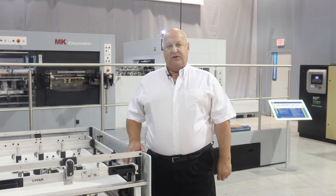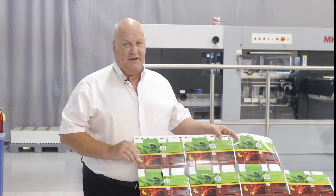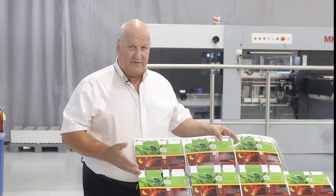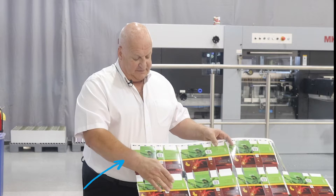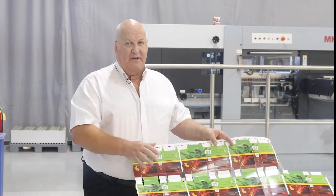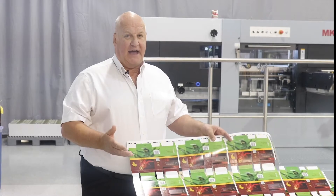First, let's be clear on what waste stripping actually means. The goal should always be to remove as much of the waste as possible, including the sides and the back like on the sheet here, and obviously we want to remove all of the internal waste. With some layouts it may be necessary to leave the side waste on to help better support the sheet — this will be determined by the layout and the speed that you want to run.